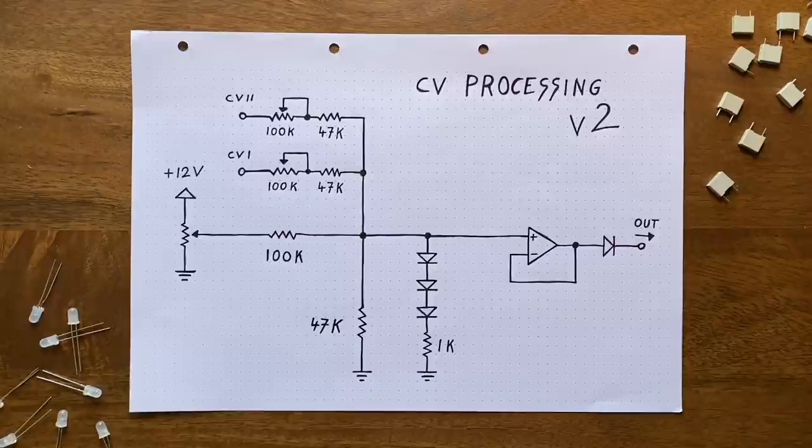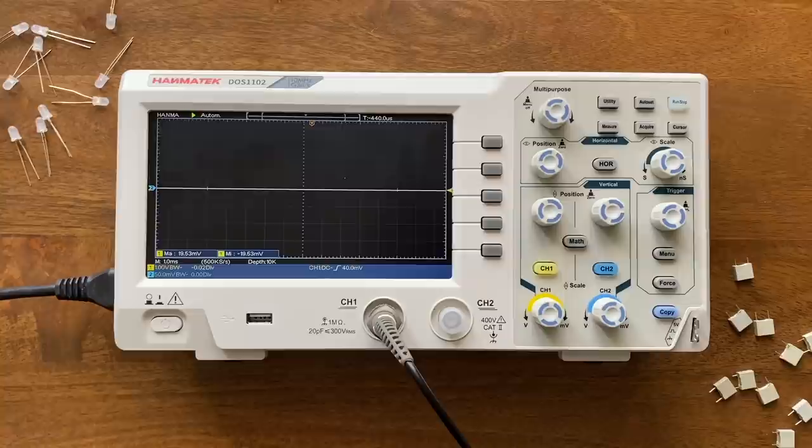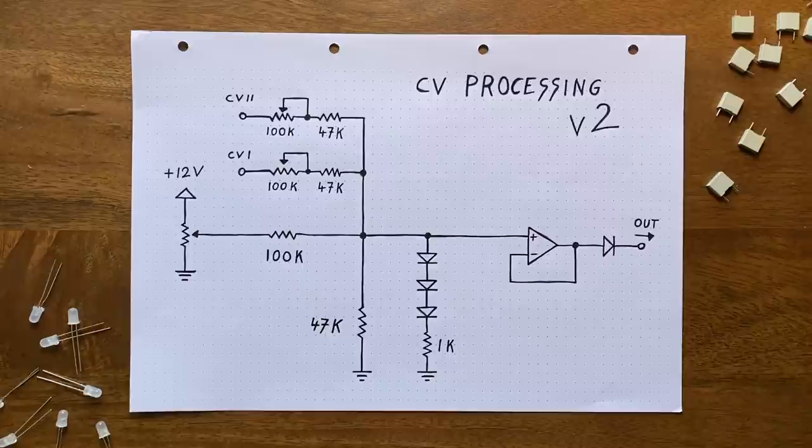This way, whenever the op-amp's output swings below the 0 volts line, that diode will block, and the ladder stays forward biased. Or at least in an unbiased mode. To check if that actually works, let's put in the diode right here. And yeah, the clicking is gone. Perfect.